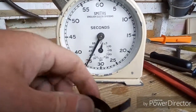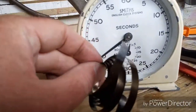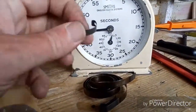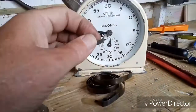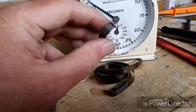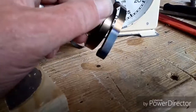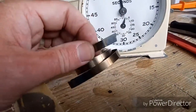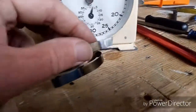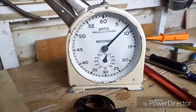It stopped working because the mainspring has snapped. I've tried drilling a new hole in the end, but it's all hardened and the metalwork is not my strong subject. I've tried heat treating it with my mini blow lamp and dunking it in water and drilling it, but it just keeps snapping. So, time for alternatives.